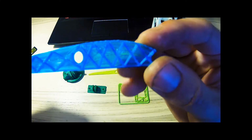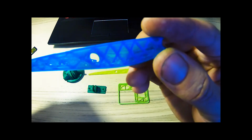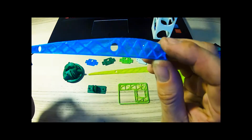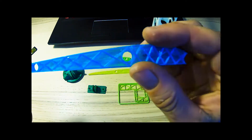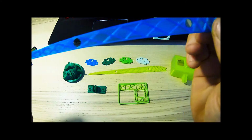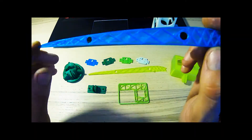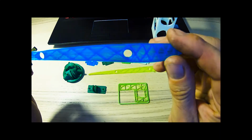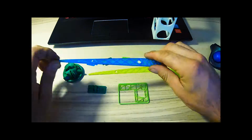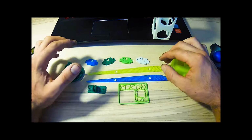There's a couple little ones in here, not bad though, compared to the PETG stringing and under extrusion. Oh no, it's not under extrusion right here on that flat side. I was using a translucent PETG, but you can see all the stringing and all the nasties coming up on this. Like I said, this was after many hours of trying to dial in all the settings to get it to not string so bad, but I've taken a break from it.